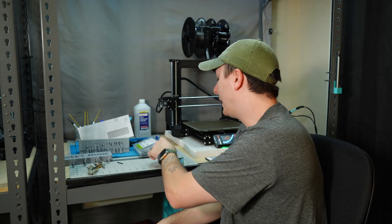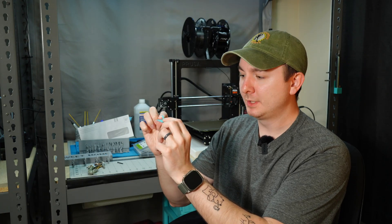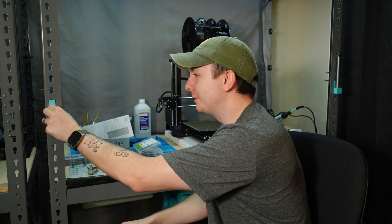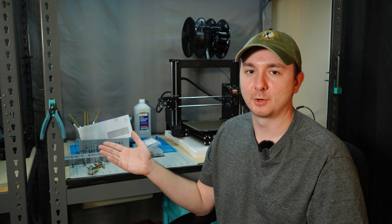I have another part that I designed a while ago, and if you look at the bottom you can see all the mess that the supports left. And it printed in this direction, which means that this hook has the layers in a bad orientation - the same bad orientation you saw Stefan snap the part at the beginning of the video. This is something I've been meaning to revisit and want to redesign using a bunch of the techniques I showed you in this video. I've printed a bunch of these and ended up breaking them over the past couple months, but they still work. Whenever they break, I just have to reprint a new one using those bad techniques and put it back up only for it to break again. If I had put a little more thought into the design, I wouldn't have to replace all these broken parts constantly.